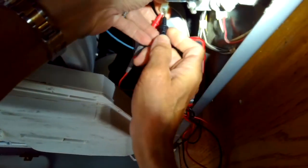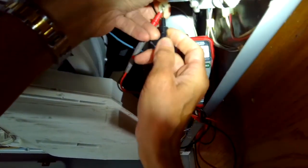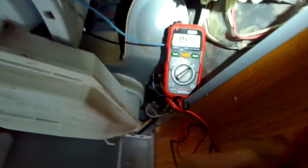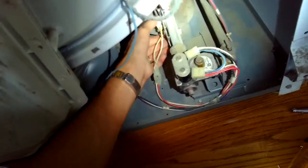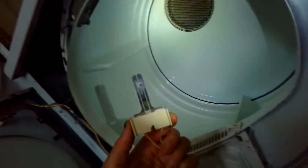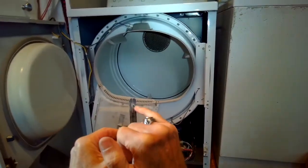I get no change on the gauge, nor do I hear anything, so the igniter has a small crack in it and the electrons can't flow through it. The homeowners think it may be the same igniter for the last 25 years, which is pretty impressive. I'm going to pull it out by removing one quarter-inch screw — you don't even have to remove it all the way, just loosen it, push the igniter slightly away from you, and then pull it right out. Looking at it, there might be a little crack in there — hard to tell visually, but with no continuity reading we know it's effectively a broken wire.